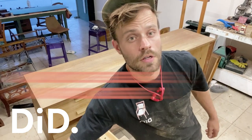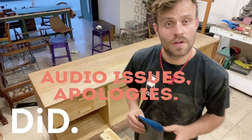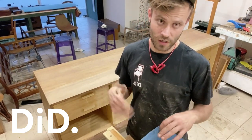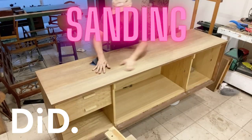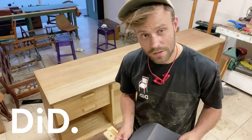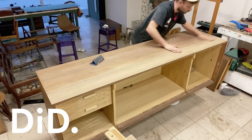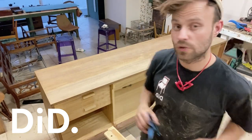This is completely stripped, and the next step, the next order of business is to sand. I'm going to sand this all by hand. The veneer's very old, it's very brittle — this stuff loves to jump off. It's actually prepared very nicely. It's been sanded quite well and it stripped quite well, so we haven't lifted too much of the grain. It's actually still in really good condition. Sanding — straight lines, 240.